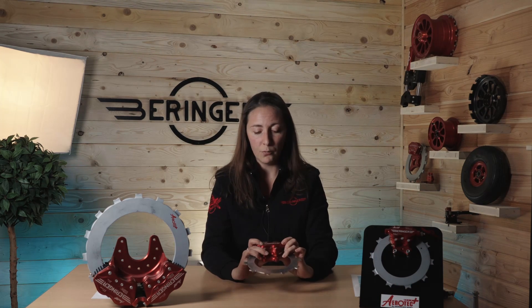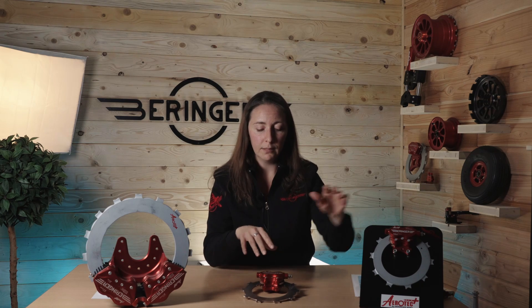The old brakes are being discontinued. So if you are an owner of this type of brake, brake pads and brake discs are still going to be available, of course. But if you are receiving this new brake technology, the brake pads and the disc are going to be completely different, so we really have two separate product lines. The new brake also includes two different disc thicknesses for different use: the thicker disc for higher energy is going to be mounted on fast light sport aircraft — VL3, Dynamic, Glastar.